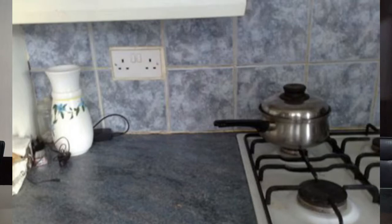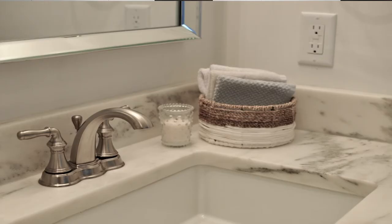So it must be ensured during installation that it is being made in a place where there is no probability of water falling on the switch or the switch socket boards, or of contact with anything flammable. For example, in a kitchen, it should not be near a gas stove or a cooking oven. In a bathroom, your switches and sockets are not installed at a position where water from the shower or any other water source pipeline may fall on the switch and socket, resulting in an accident.